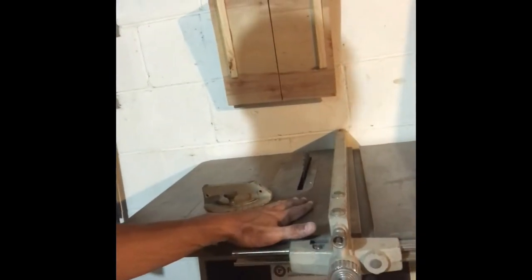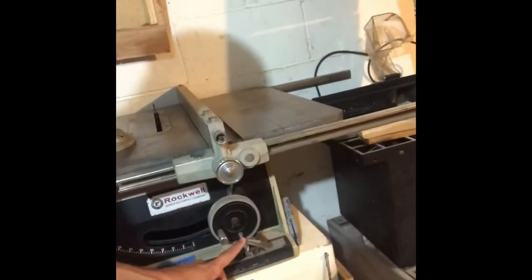I got this situated - I need some runners for the crosscut sled because I sold my old Craftsman one and got this upgrade for 40 bucks, well worth every penny. This Rockwell Delta is pretty nice, I got it tuned up and cleaned up. The only problem is it drifts a little bit, so I got to put a clamp on it to make sure the blade doesn't lower. It's a pain when you're trying to crosscut and the blade's not going all the way through. I looked at it online - you can tighten the clamps, make sure they're dust-free, because if you get a little bit of grit or wood it'll cause it to drift or jam up.